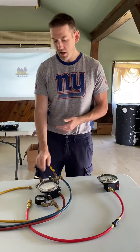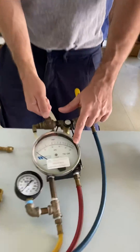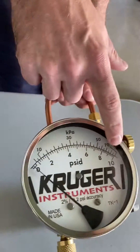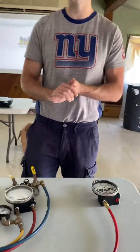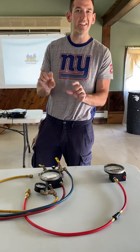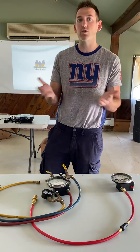The second big difference is that the Watts Regulator goes all the way to 15 PSI — so it's 0 to 15 — and ours only goes 0 to 10. You're never going to need more than 10 because the maximum test you'll need for the RP would be at least five. So if it's pegged out at 10 — say it's really 11 but pegged at 10 — that's not a problem; you just write down 10 because it only has to be more than five.